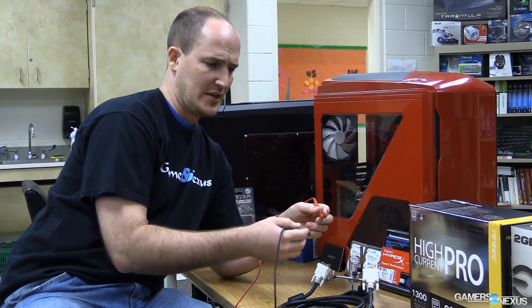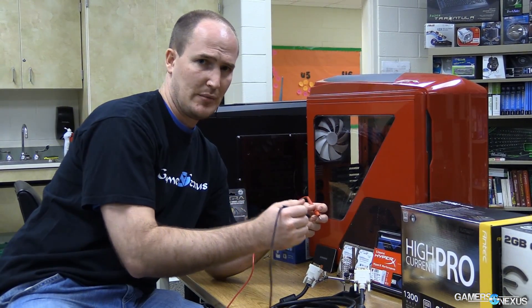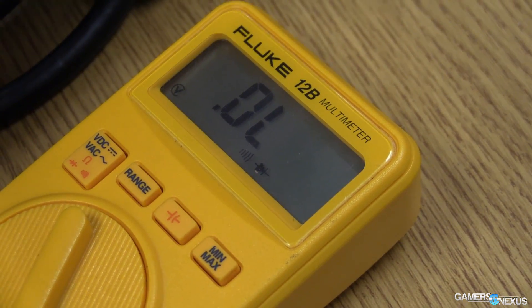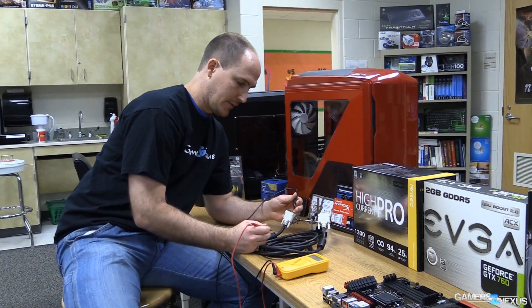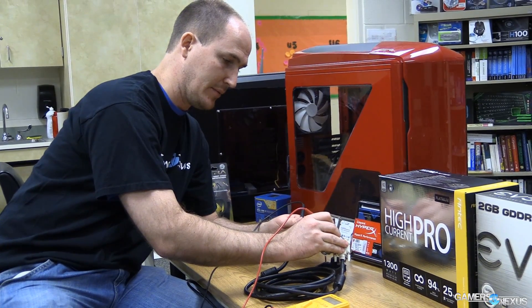You can do that same test for column 4 pin 2, pin 3, column 5 pin 1, 2, 3, and then you can guarantee that you have what you paid for. You're probably going to pay a little more for an actual DVI dual link cable. While you're testing, if you see something like this — I'll touch column 1 pin 1 on one side and column 1 pin 1 on the other side...